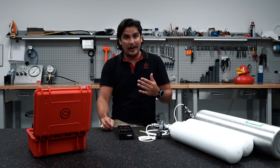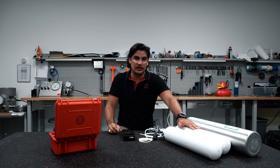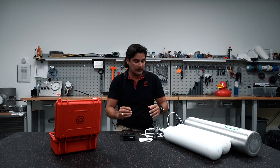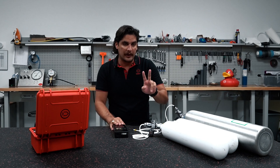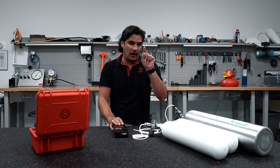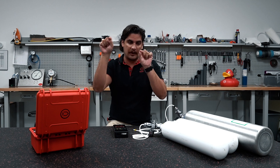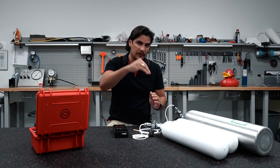What is a three-point calibration and when is it necessary? Typically you have a single-point calibration, which is done with air — the oxygen concentration is 21%. When we calibrate, we tell the analyzer to calibrate at 21%. A two-point calibration uses a 21% air mix and then a 100% oxygen mix, giving us two points so the analyzer knows what the millivoltage is between the two.